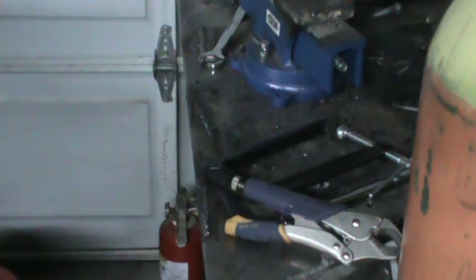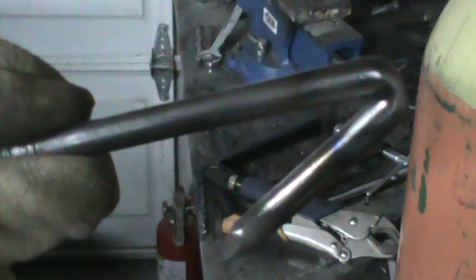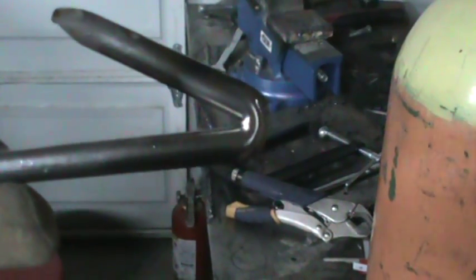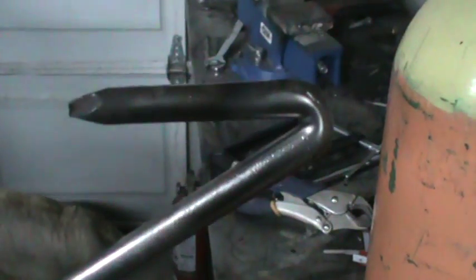Let me hit it on the grinder and you can see it ends up looking clean. There you go — a nice bent piece of steel. When you bend it using heat, it holds its temper a lot better. If I bent this without heat, it would start cracking right at the bend and wouldn't have any strength. I'd basically be able to just pull it and break it. But when you use heat, it holds.